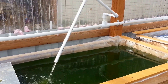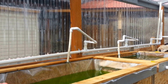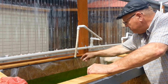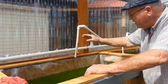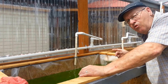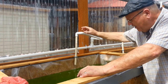I've got a couple of these done where you go from something crazy looking like this, to something that looks like that — fastened down. What happens is how much water you get — your water flow — is dependent on how high this is. If you push it down, there's water coming in, and what you want to do is adjust this so that the water coming in is about right. One thing you don't want to do is start this siphoning because then it'll mess up the pressures in this manifold. So I've got a little hole drilled up here to break any siphoning that might occur.